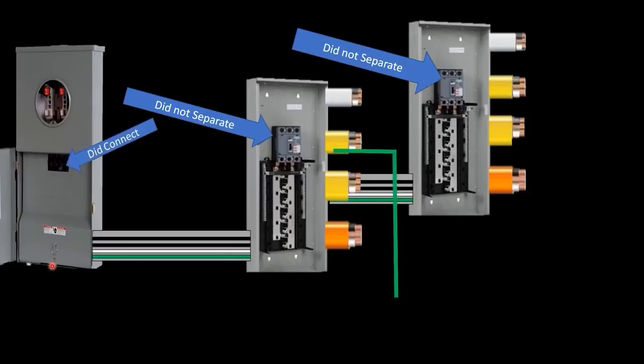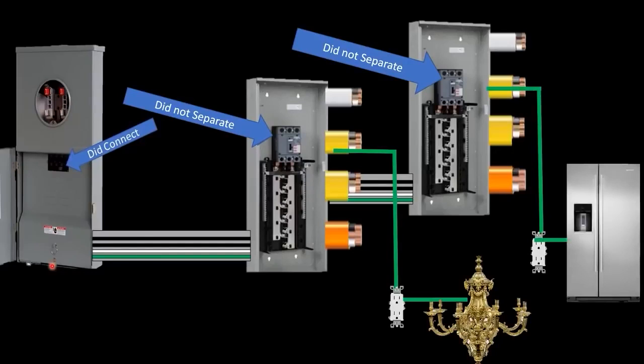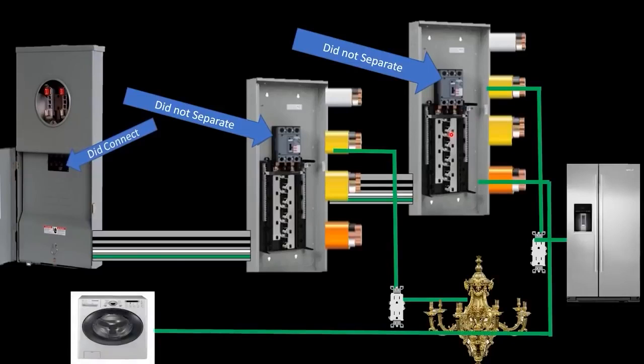Let's imagine we come out of this panel to receptacles and a metal lighting fixture, and out of this panel to receptacles and over to a refrigerator. Every circuit leaving a panel has an equipment grounding conductor in modern wiring. All of these ground connections are likely bare conductors touching multiple metal points throughout your system. These circuits could have their grounds connected somewhere downstream — and actually that's what we want. We want all of the grounds in the entire system to be well interconnected, so if there's a fault anywhere it will quickly clear. We also have a ground wire going over to our dryer.